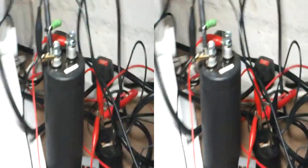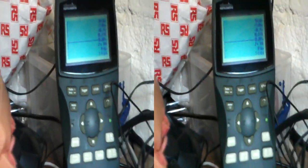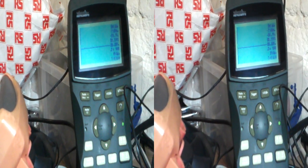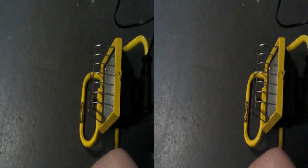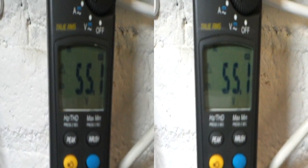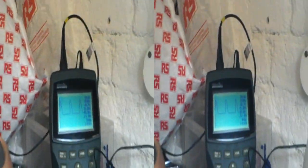And we've got our pretend battery, which is a capacitor. There's the electrics coming in and the fuse. So I can now turn this up a bit and you'll see the phase come in — there's a quarter phase. You can see the light comes on just there — that's a quarter phase, and we've got about 55 volts, hovering around 55.